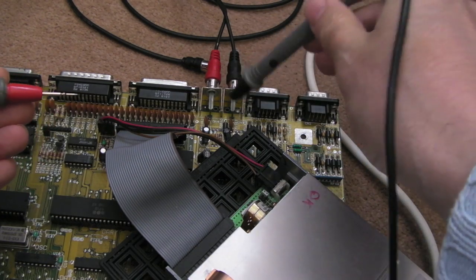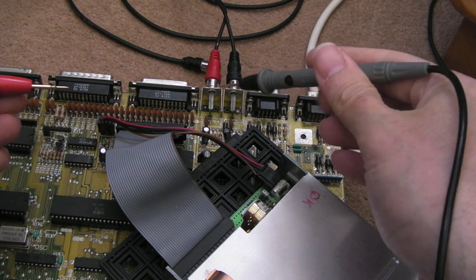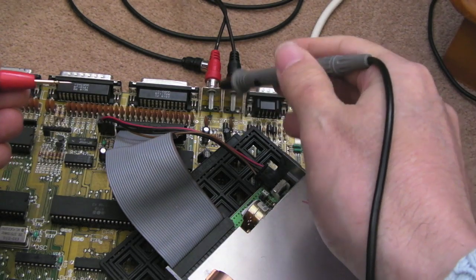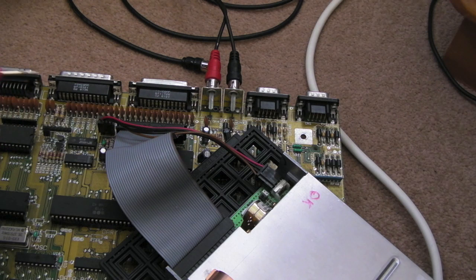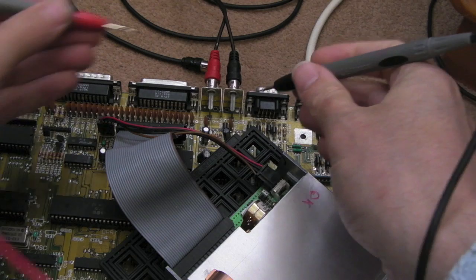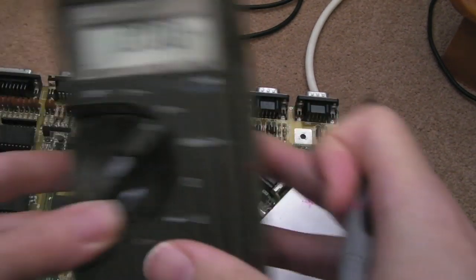I made the first mistake — I thought Jan was probing down here, but in retrospect it was actually obvious he was probing the positive side of the cap. So it's the point before the coupling occurs by the capacitor there. And the interesting thing — something I wasn't aware of at all — is that there's a DC bias there. Again, this is a tip picked up from a number of people commenting on the last video.